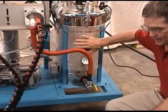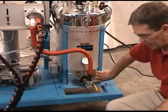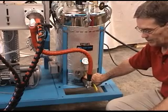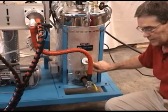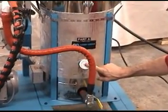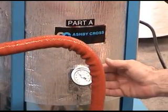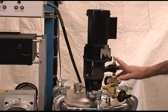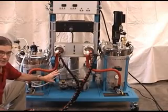Each tank is heated and insulated, and has an analog material temperature gauge. The bottom of the tank is a CalWatt heater embedded in a thermal heat compound, with a thermocouple set against the bottom of the tank. This analog temperature gauge gives the actual readout of the material temperature to help in processing the two-part adhesive. When heating the tank, it's also important that we agitate — this happens to be a 10-gallon tank — to ensure a uniform temperature profile in the material. We've added seven heat zones.